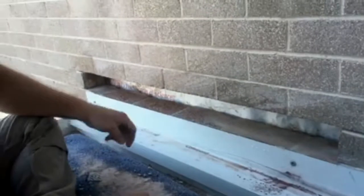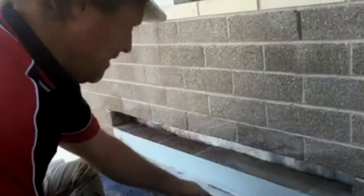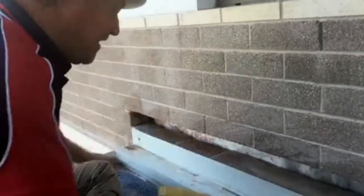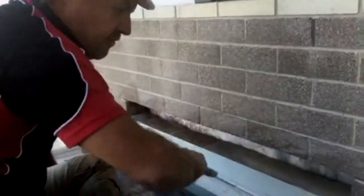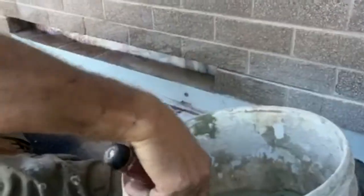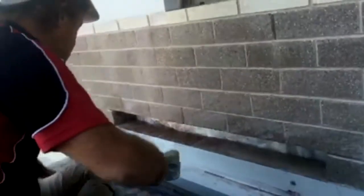So what I've done here now is I put an under flashing into the box gutter, and this flashing is coming flush to the top of this bottom brick here. What I'm going to do now, I'm just going to wet the brickwork to stop the absorption of the mortar, and I'm going to insert the trays in. So you always wet bed the trays, not dry bed.